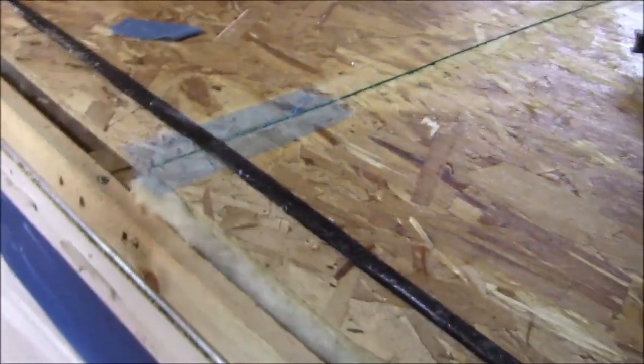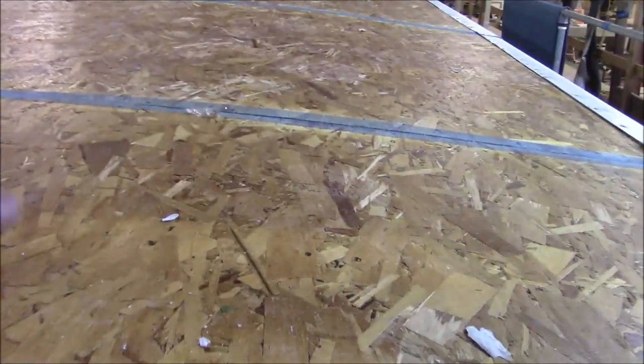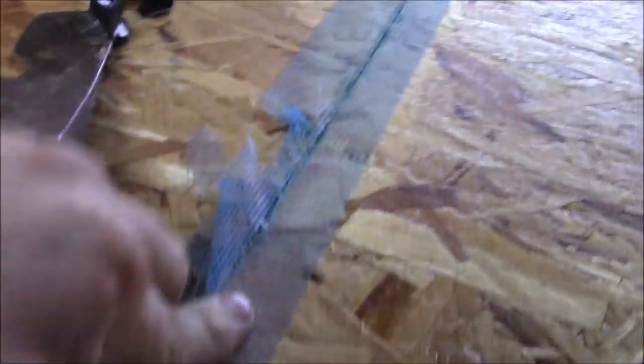They had all this pinned down — we've got our staple guns here. We're going to re-staple this all down. We took this shoulder off, and you would think, well, why do we need to take the shoulder off? We really don't have to. We could just staple it down, put our protective strips on, and throw the roofing on and roll it over. But here's my thought — I was showing that this is just pinned, it's not glued. There's no glue in there at all. They just use little pin nails, about an inch and a quarter, very small. So we're going to re-staple all this.